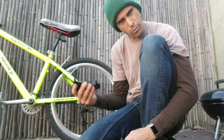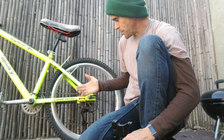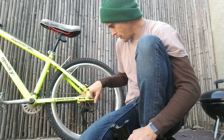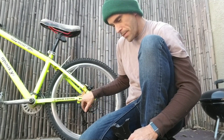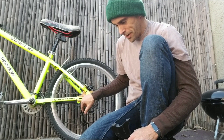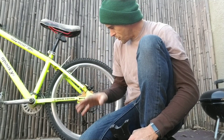This is my previous brake adapter. If you saw my last video, I was trying to figure out a solution to put a newer style disc brake on this bike, so I 3D printed a part that is actually still working, shockingly. This part is made out of PETG, printed with a 30% infill, which is ridiculous, and it works and it's held up, but it flexes a bit and it looks a little sketchy, and there are a couple things I wanted to change on it, so I've made a new version.